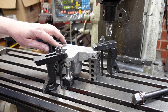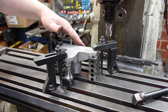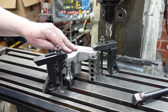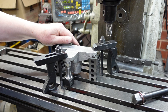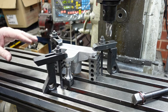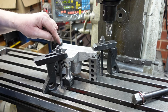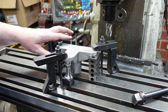This casting is a rather simple one to machine. All I need to do is clean up the bottom surface, and once I've got that flat I can bore a hole into this cylindrical piece here - that hole should be square to the surface. There are also three holes here for hold-downs, but that's secondary. I've got this clamped down on a couple of 1-2-3 blocks, measuring from there to there - it's almost the same height and by the time I clean that up it should be fine.